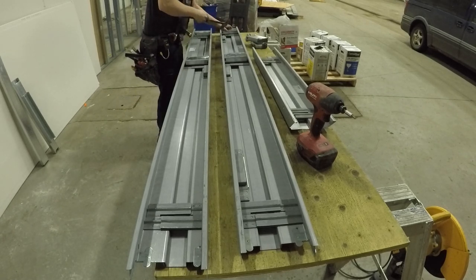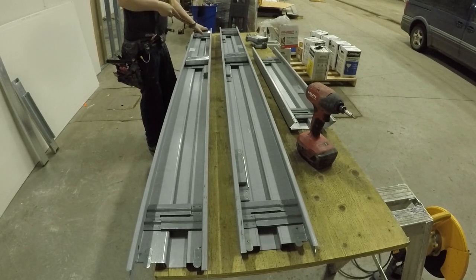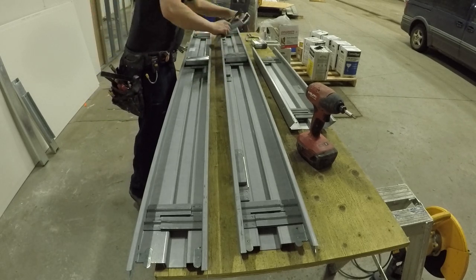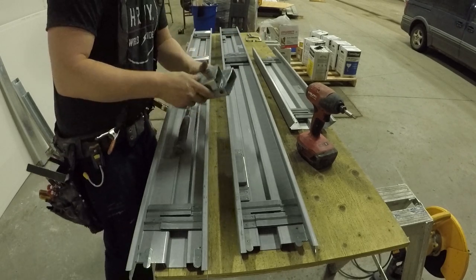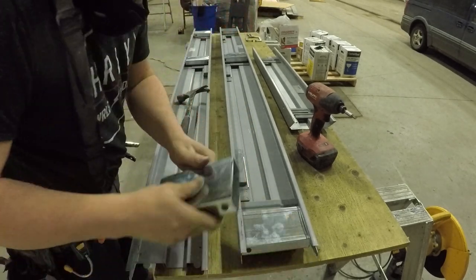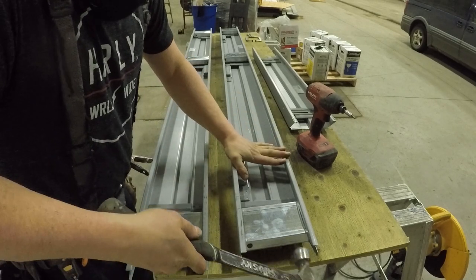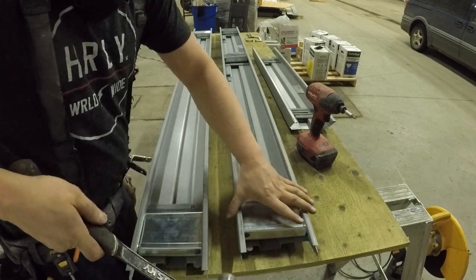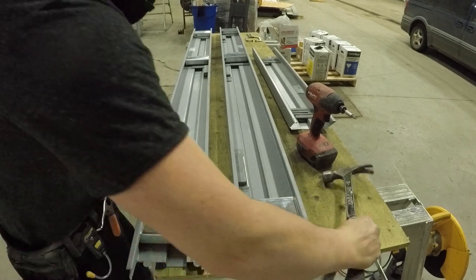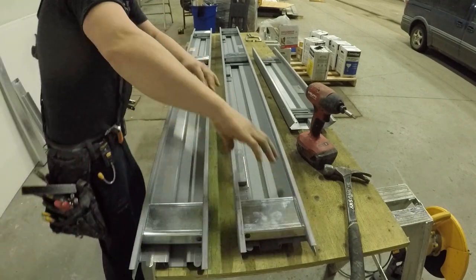And it's amazing because the clips are tight. You got the wafer in there. These are very, very strong frames, okay? They don't have the angle at the bottom for hammer drilling them into the concrete. So you got to keep that into consideration, okay? They have to be very, very strong. And they are. And this is the only way to do it, right? You can use different gauges of steel if you'd like, but make sure you test and see what works, right?